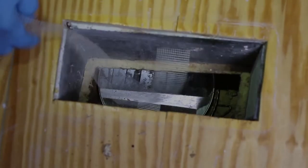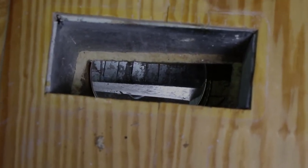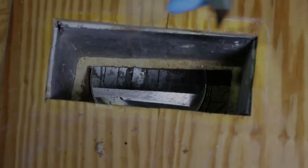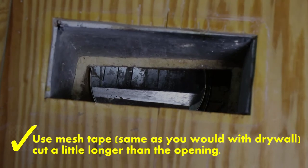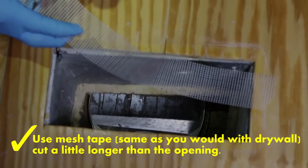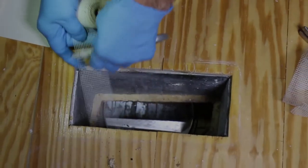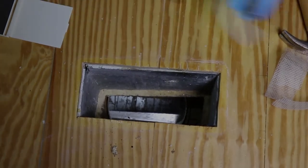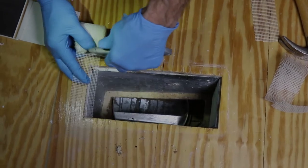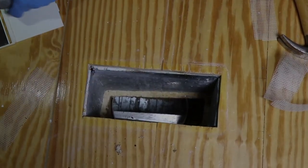So now I'm cutting some two inch mesh tape. This is very similar to the tape we use in patching drywall seams and drywall tape. I'm cutting them a little bit longer than the actual opening itself because those pieces will overlap and fill in that gap area. After they're cut, I'm going to get out the mastic and we'll be using either one of these two different types of mastic to seal up the holes.